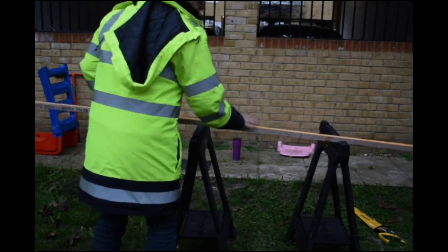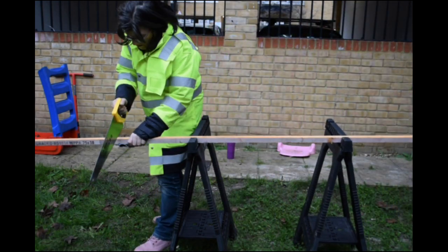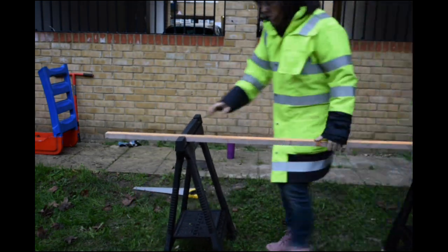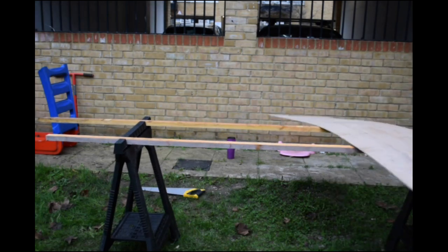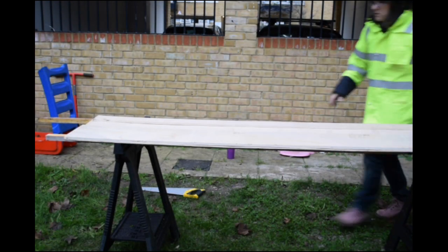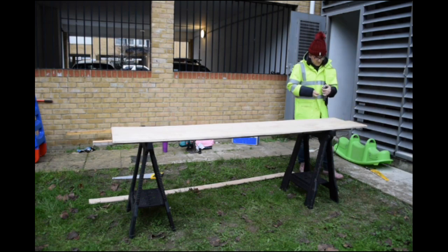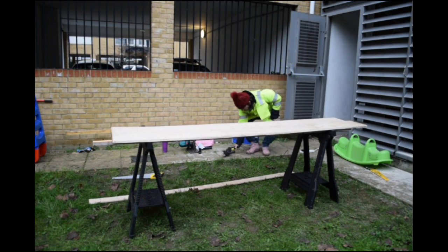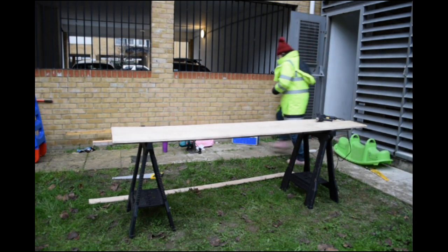It's the next day. I've gone out and got a bit of wood to turn the saw horses into an on-the-go table - I've cut it roughly in half, spread them out, and now I've got a fairly sturdy table. The next step is to lay the 6mil ply down as the base, then place the two 12mil bits of ply on top. You don't need to worry about getting this square because what's important is that straight edge on the 12mil ply. My drill cord isn't long enough so I have to start from one end and then turn the whole thing around.